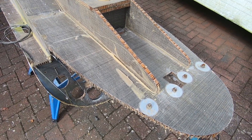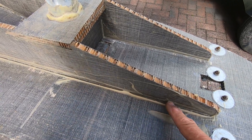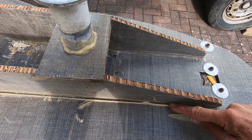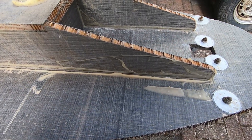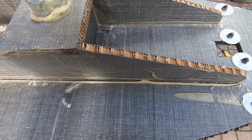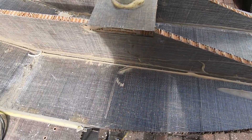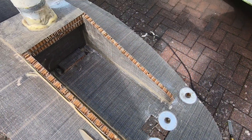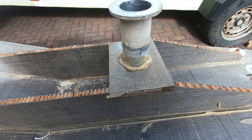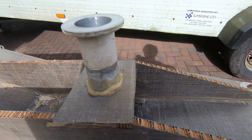I just discovered a new way of saving weight. The epoxy that glues these fins on for the nose leg attachment - a spatula or screwdriver has been used to force the glue into the join, but in doing so it's squished some of it out, forming a ridge away from the joint which is providing no additional strength but is adding weight. There's glue squished out here, so there's an awful lot of glue that can just be heated up and scraped away, which I've done on this side. In repairing this nose leg, excess glue has been used, so that's more weight that can be pared away.